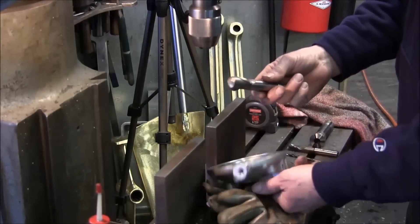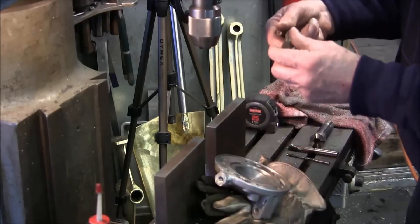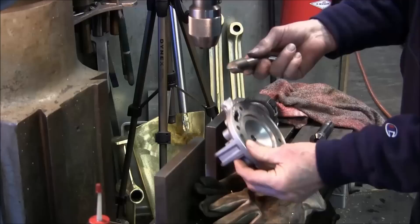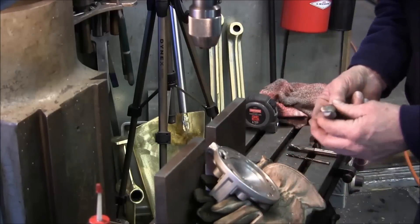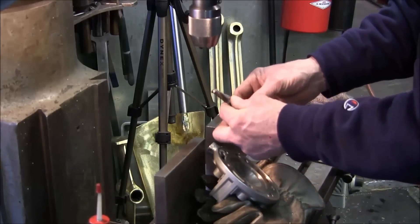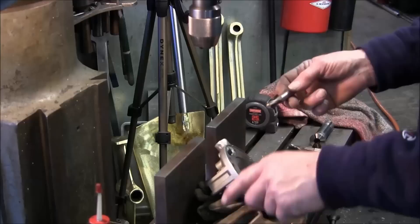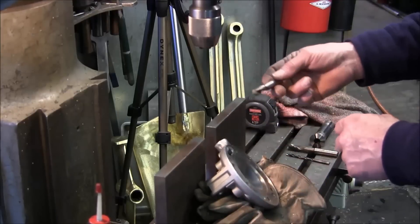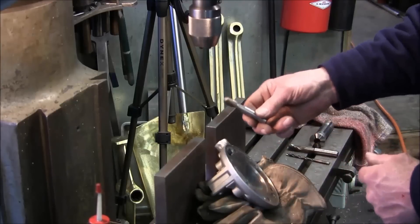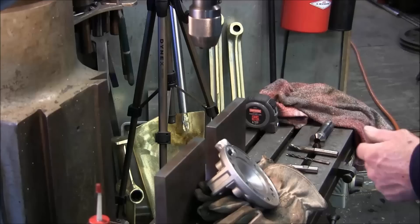I had to laugh — I was looking for ball end mills and this one-inch one is almost exactly the right size, but I'm going oh yeah, you grab it with that and you throw the part on the floor. So I found a half-inch two-fluter which is going to be kind enough to get in there and get started. If we feel confident we want to open up to the top or something after we get in there and get a feel of it, we'll play with that or go to a three-quarter. I have several of these ball end mills in different drawers.